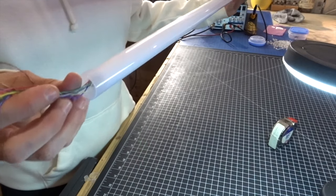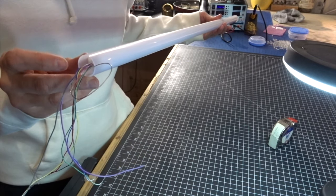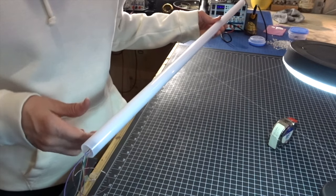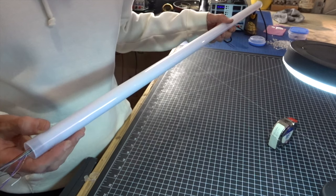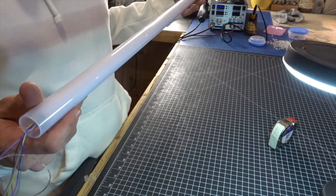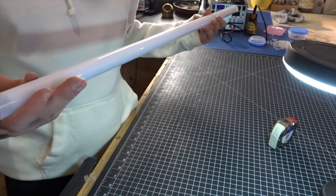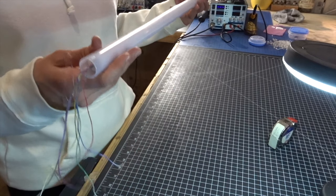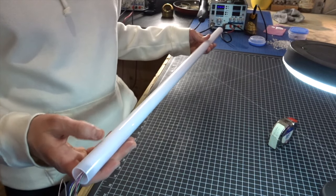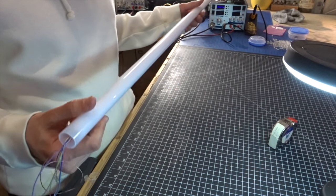And I think that the mechanics of it came out perfect for what you're going to do. As far as diffusion methods inside this, everything is wrapped in two layers of heat shrink, which is a clear heat shrink, but I think it helps to diffuse the light a little bit. Then we have the Makoto foam inside there, and this new batch of Makoto foam that I recently got seems not to fit inside the Custom Saber Shop nylon diffuser tube, but this color blue along with red and green look the best in this trans white style Custom Saber Shop tube. So that's what I've done here. That's another layer of diffusion. Like four or five blue blades I've put in this style tube. It's a really, really nice even effect.